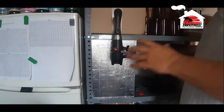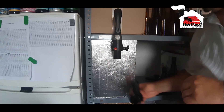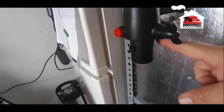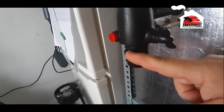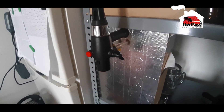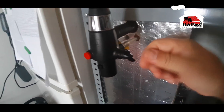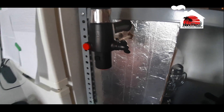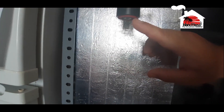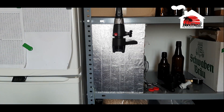You cannot just start now because depending on the kind of bottle you must adjust first. You have to see here — there are these holders for the stoppers for the clamp lock, and depending on the size of your bottle you need to change it. You just change it this way or the other way. Also one other thing is the rubber gaskets in here — the red one — it depends always on the size of the bottle as well.